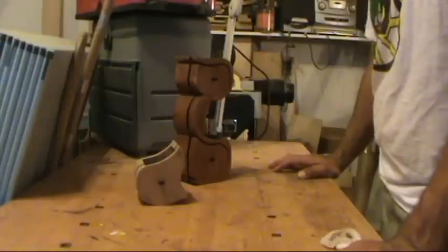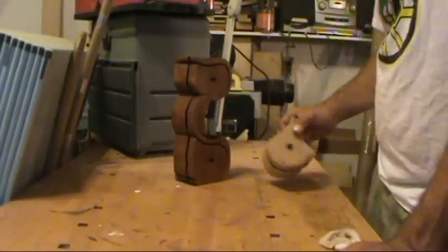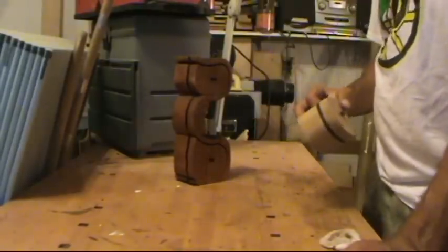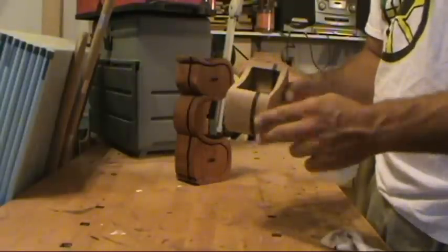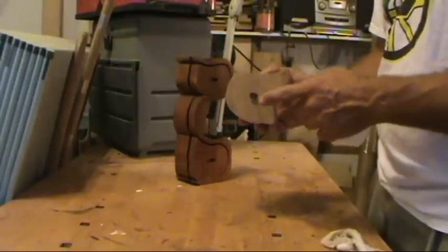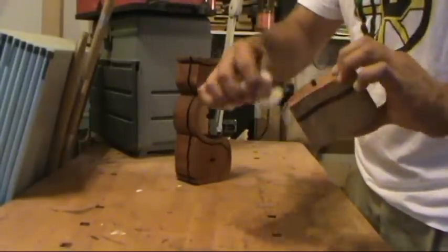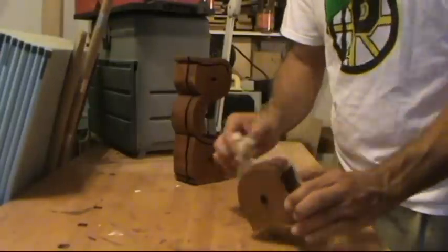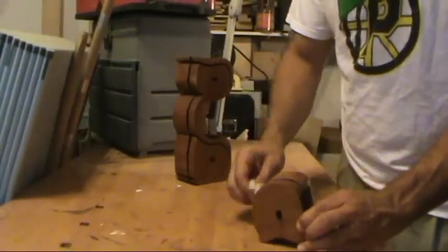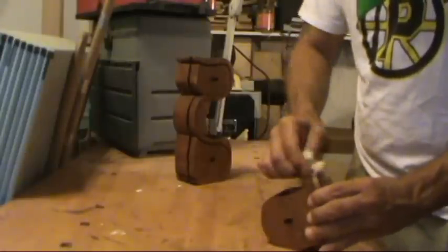Okay, here we go. I'm right in the middle of finishing the box, and I sanded it down, and I'm using some tung oil for a finish, and I'm doing the last box. As you can see, I sanded everything down, put some little ebony knobs on there, draw pulls, if you will. I'm using about two or three coats of tung oil. This should do it. I really like the way that ebony pops out of there with the mahogany. It looks really nice. And I'm just using a soft cloth to rub it on. And that's pretty much it.